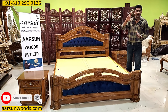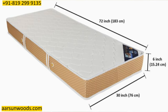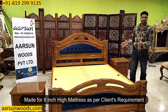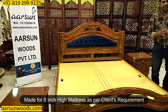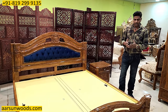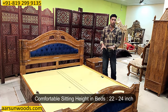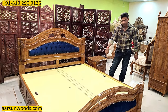About the height: mattresses come in 4, 5, 6, 8, 10, 12, 15, and 18 inch thicknesses. This bed is made for an 8-inch mattress height as per the client's requirement. If you use anything above 8 inches, this middle area has to be lower. The comfortable sitting height for any person on a bed is around 22 to maximum 24 inches, so very thick mattresses leave very little area for the middle part.